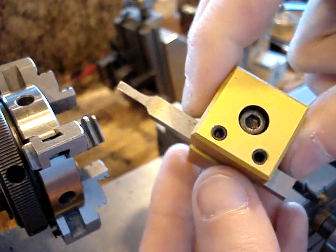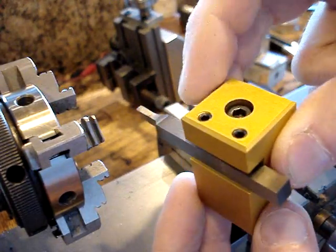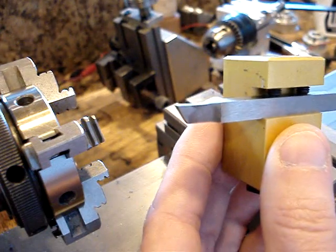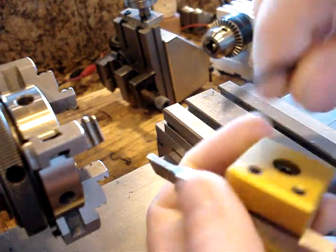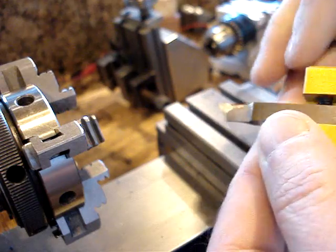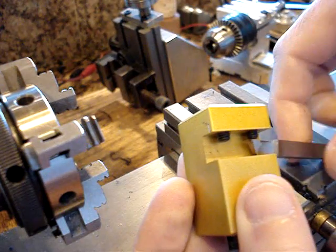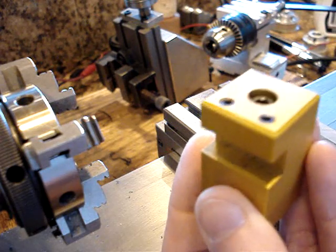It's anodized. It's just got an Allen bolt that runs all the way through — nothing fancy. I think it's like a 10-32 or something. And then it has a little groove — it's not a quarter inch because these are quarter-inch bits, but it's got a 3/8ths groove milled into it. And then it's just got two very tiny Allen head set screws.